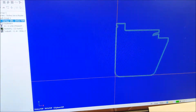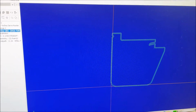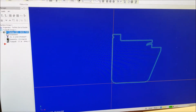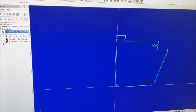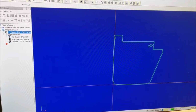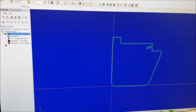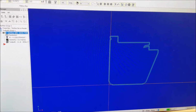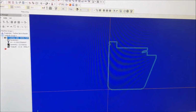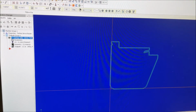Then we came over to Mastercam X9. The metal shop teacher ended up drawing this off of that template, and then I just tool pathed it. What kind of board are we cutting it out of? It's starboard plastic, polypropylene plastic. It's a maritime plastic, so it's completely good underwater. The only downside was when we tried to laser cut it, it all melted.